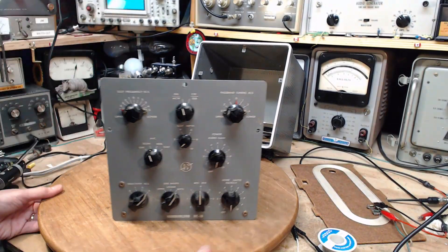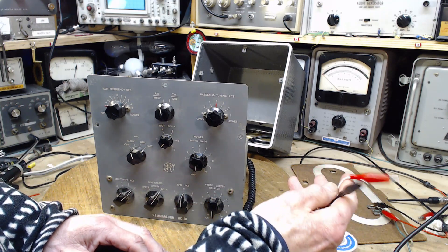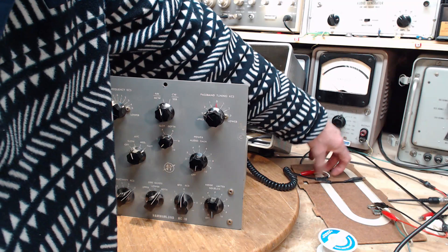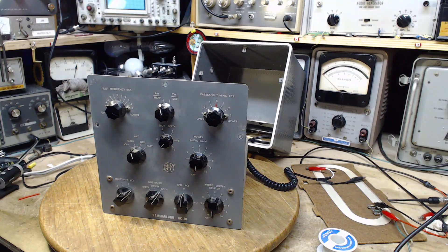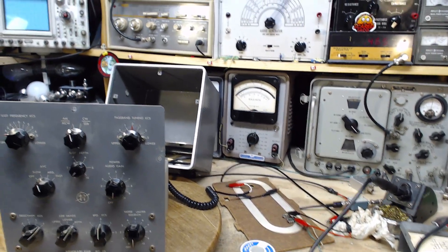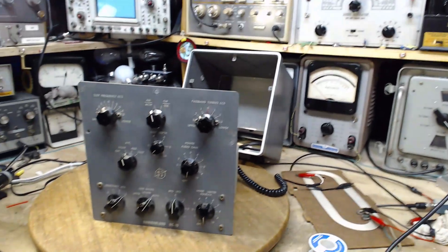I have a speaker connected to this. For the input, since I don't want to fool with that too much, this is all I've got — just plugged into the input of this, so it's acting a little bit like an antenna. And I have this coil sitting here; I'm just throwing this on top in hopes a little bit of signal will leak into the wire and this thing is sensitive enough to react to it. I have my signal generator running back here. You can't see the number but it's at 465 — actually, let's put it at 455. So I already know this is actually tuned at 465 but we'll start there.